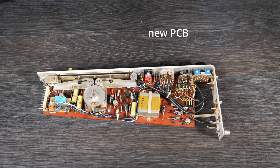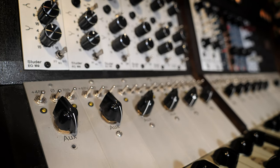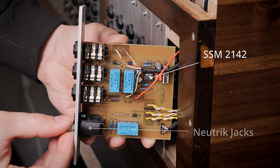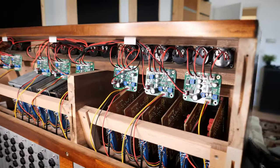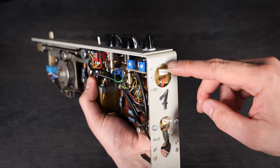To realize this modification, I produced a small PCB with two trim pots. For adding phantom power, phase reverse, a balanced direct out for every channel, and more routing options, I decided to design an additional PCB — here it is. For balancing I'm using the SSM 2142 chip, which in my opinion is as good as a transformer. Soldering the XLR and TRS connectors directly onto the PCB makes it easier to place them on the back panel. By the way, I designed and etched all PCBs myself. To connect the mainboard with my self-made PCB, I replaced the old-school Tuchel connectors with PCB connectors and wired everything up.